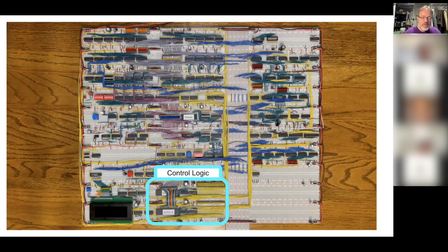For larger programs, manually clocking through 10K of code is very tedious. So I used the classic approach of adding print statements — once I had the LCD display working, I could print values out to it and debug that way. Of course that required the LCD software to be working correctly first, but for the bigger programs, that's how I debugged — good old print statements, not the best with modern tools, but it's what I had.